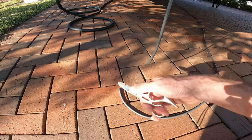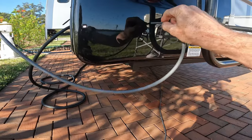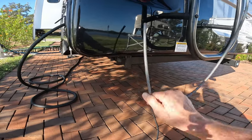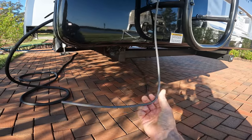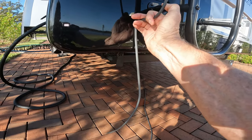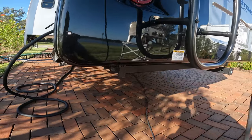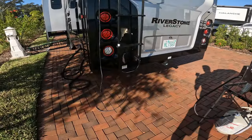I'm going to put the connector right here and I want enough slack so the cable comes down and loops up, creating a drip loop. Once turned like this at an angle, any water that collects on the cable will come down, reach this point, and drip off — rather than going straight in tight where water would tend to enter the connector. Even though it's an IP67-rated waterproof connector, I just don't want to take unnecessary chances, so I'll leave a little service loop like that.